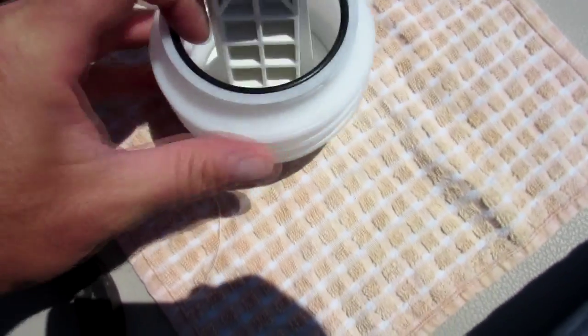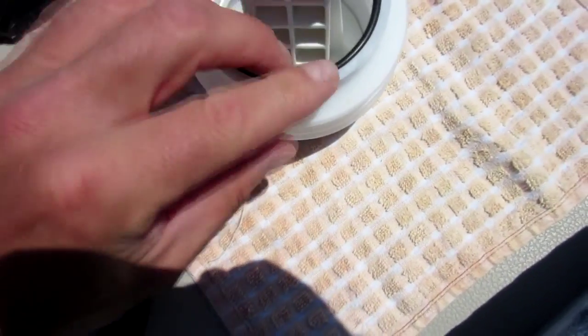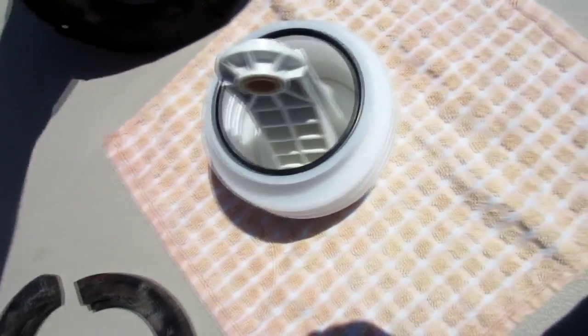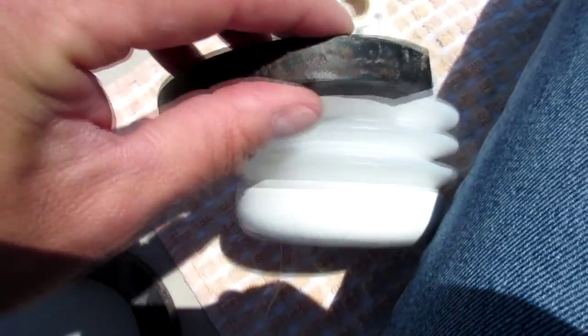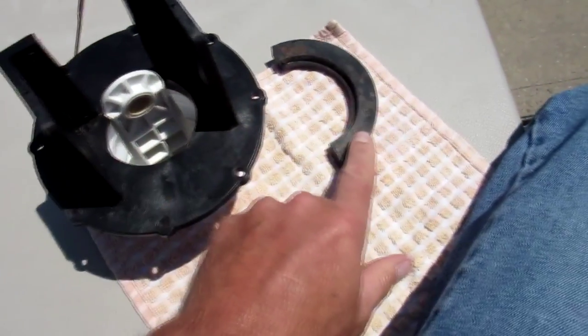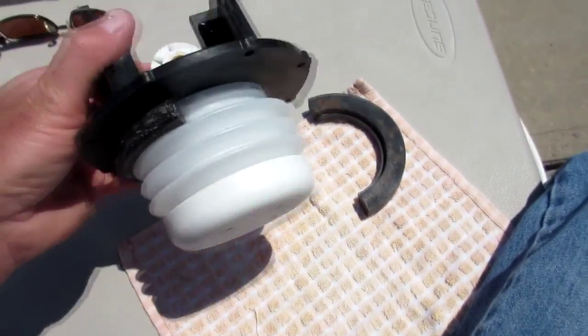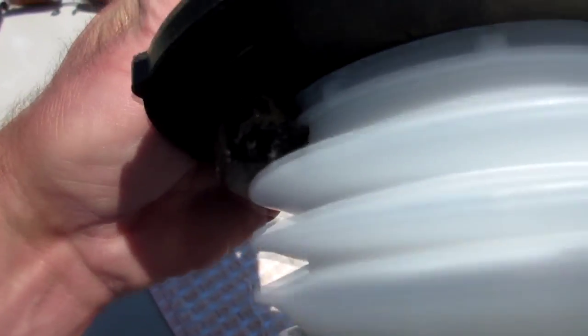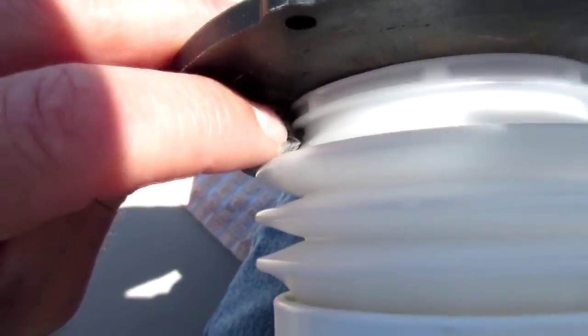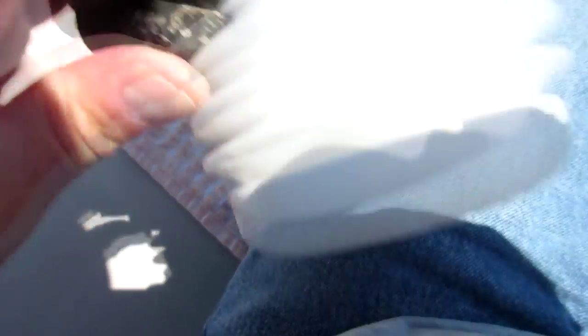The o-ring goes in there - there are actually only two o-rings in this kit; I thought there were three but one was just doubled up. The housing will slide into there, and once that's on, this clamp just fits over it to hold it all together. You can see these C-shaped two-piece clamps slide over and tighten up - see how it's notched out to fit inside there and make it all snug and secure.